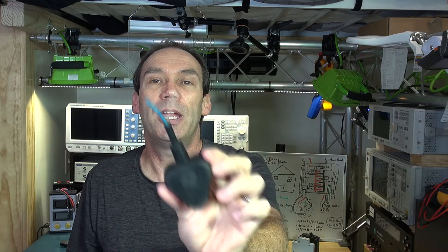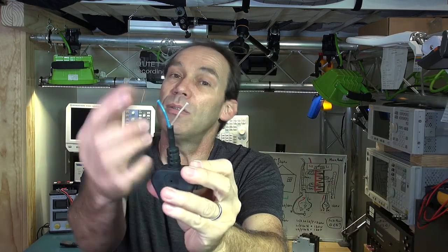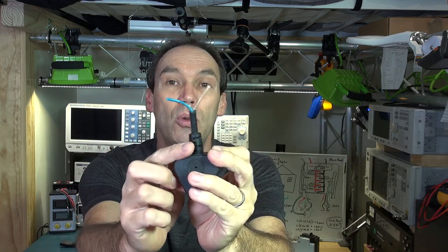They saw the color of the wiring and made a statement or assumption about the neutral and whether it was switched or not. It was very good of them to raise that question, because when you see the color of wiring you're going to make certain assumptions. For instance, in South Africa the plug wiring has a blue for neutral and a brown for live. Transformers bought here in the USA — probably produced in China — have a color code which doesn't conform to the US standard, and that can create confusion.